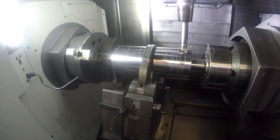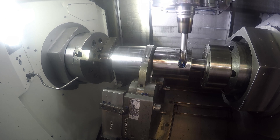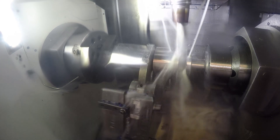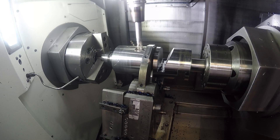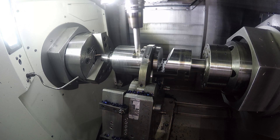The first thing the probe will do is come in. Then the next tool basically needs to remove as much material as possible, so we're using the biggest, burliest, fastest tool we've got — our high feed tools. We'll hog the web profiles out into a basic shape, leaving about 1.5mm stock all over it. Then the finishing tools will seamlessly blend the radii together, and the end mills blend all the cheek angles and leading edges.